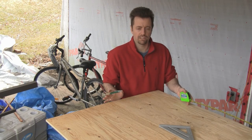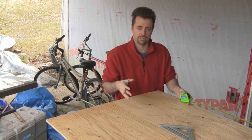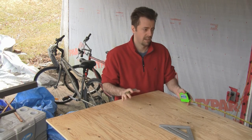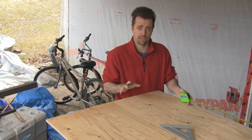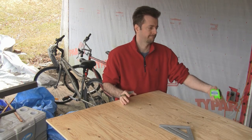You might want to leave maybe a 1/2-inch larger than the mattress so you can fit sheets and blankets down the sides, but you want to be pretty close — a snug fit — because this bed is going to have to hold itself up against the wall. I've got a few knots in this board that I'd like to fill before we paint, because I bought an inexpensive sheet of plywood. There are a few gaps here that I need to fill in.